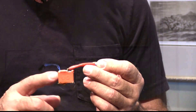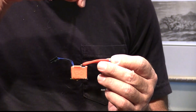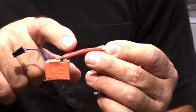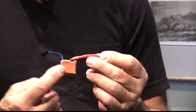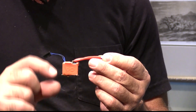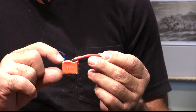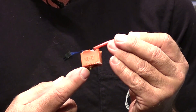This is the hot end — this is actually the old hot end. It sits in the printer and the filament comes from the extruder wheel and goes down into this. These two wires hook up to the heating element that actually heats up the whole unit, and this much of it turns into molten filament that is extruded out of the nozzle on the end down here.